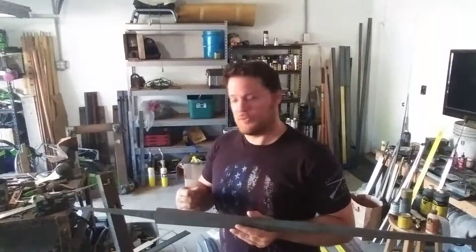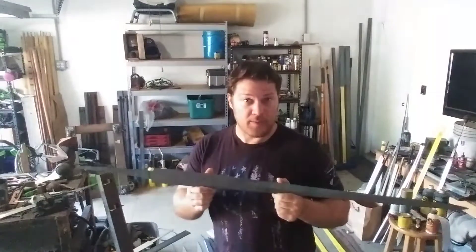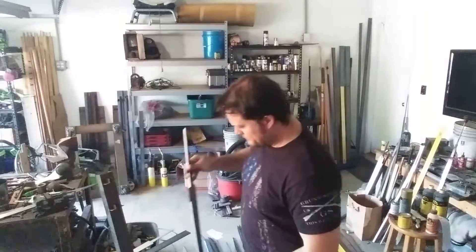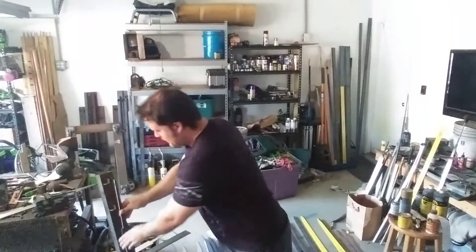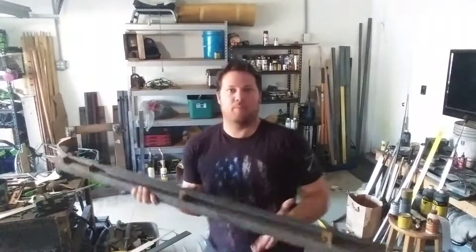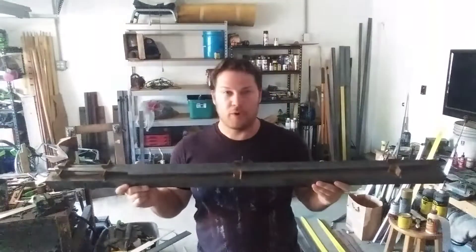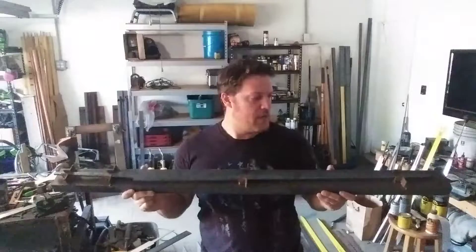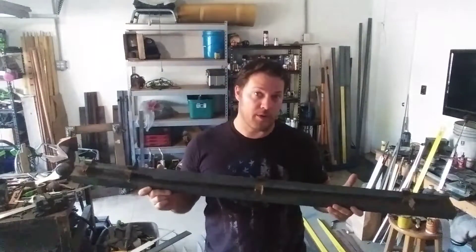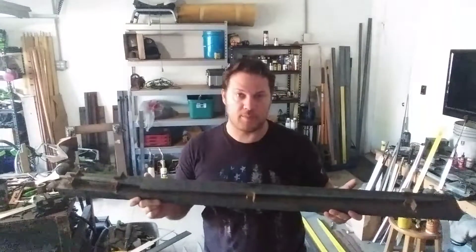What we do is build fixtures for each individual blade. This is a Type 15 blade that's going to heat treat soon, and the fixture for it is right here. These fixtures are quite heavy — we build up and weld our own fixtures per blade, so we have one for every blade design we have. Once the blades come out of the quench, they get pressed back into these fixtures to force them back into the shape they were.